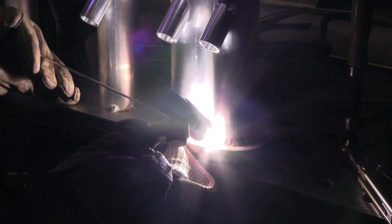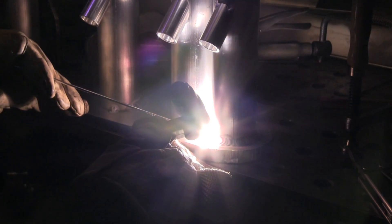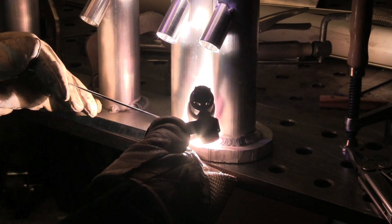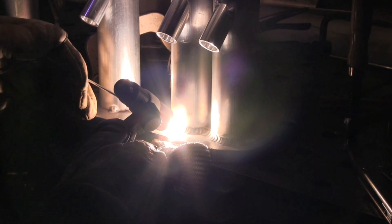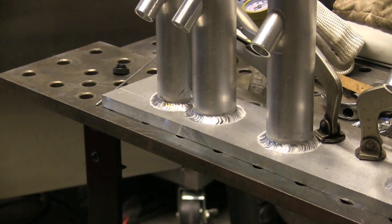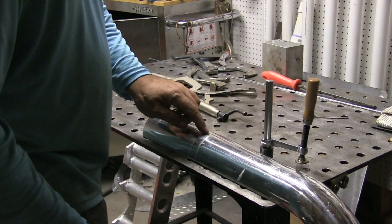One thing I noticed right away is the puddle was just not as clean, and I didn't really know why. I thought maybe the base plate wasn't cleaned as well as I thought, but it just wasn't quite as clean as I'd like. Even though I have the settings set all the same, I really think I have a small leak somewhere — either in the torch fittings or somewhere — because here's the way that puddle looked: just some oxide films floating around. Even though I cleaned it with chemical aluminum cleaner, a Scotch-Brite pad, and then acetone, it's got some oxides floating around in the puddle. It did the job okay, but I'm going to swap torches to get to the root of that problem.